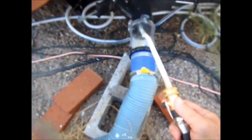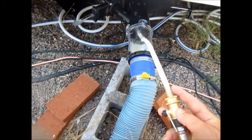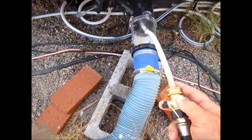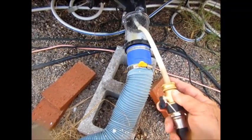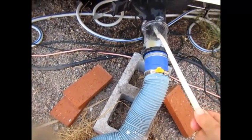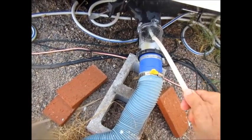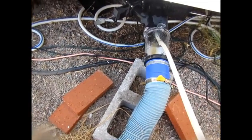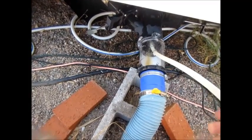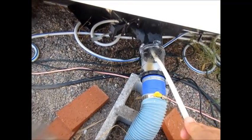We've got the hookup on a different kind of hose — the street sweeper hose attachment — and you can pull it off as we just did. I have a 3/8 barbed adapter that's actually made to do this. Turn the water on, and we've got to pull it back a little bit until we find where the plug is. We'll leave it sit right there for a minute and fill up, because as I pull back I'll hit the plug and it's gonna start breaking everything loose. There's a pretty good pile of stuff sitting in here.